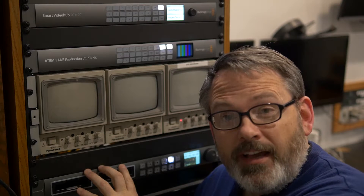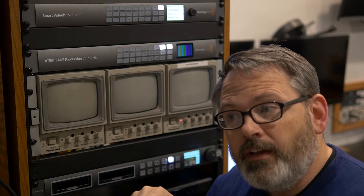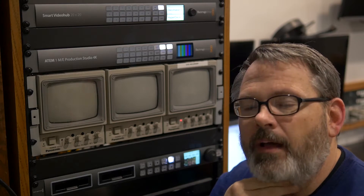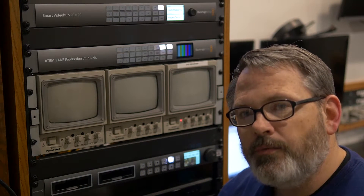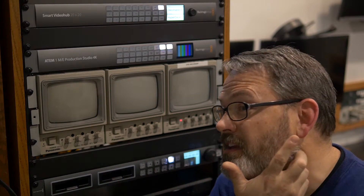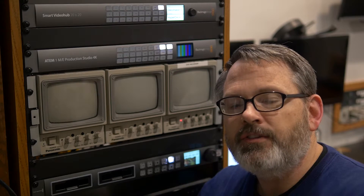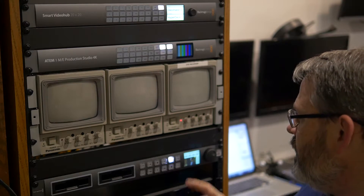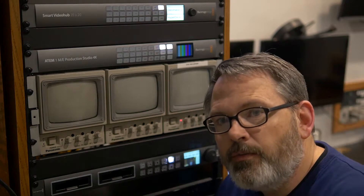I've got it hooked up in the back — I've got the input and output of the HyperDeck routed through my Smart Video Hub. When I set up the HyperDeck, I plugged the SDI cable into input D and output D, and it should have been A. I made an assumption that since this was a 6G unit I could use the 6G output, but I think I misunderstood it completely. The input and output A are the ones I used, and it's working just fine — it's showing 1080p 30, which is what our standard is.